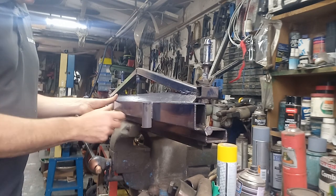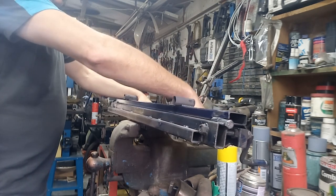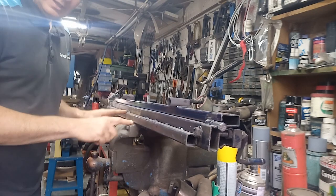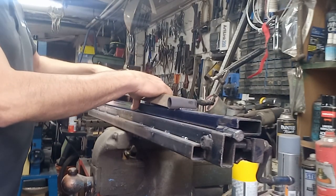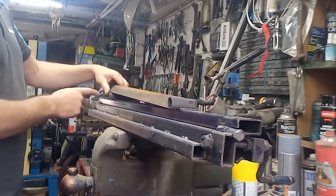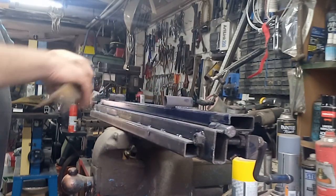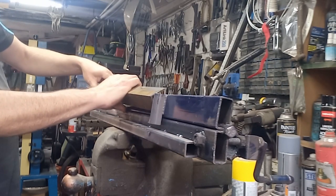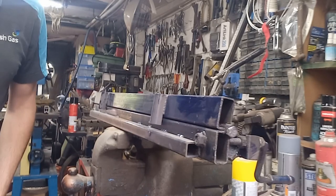There's got to be a way of doing this somehow - getting something on there - but it does mean I might have to weld another piece on there to bring this stuff to sit higher in the vice. I think if I do that first and then see where we're at, because what I'm thinking is something like a bit of angle between those two bits. On the edges we're okay, it's just the flex in the middle here, so I think a bit of angle cut and chopped off there and just stitched across there hopefully will give us the strength we need to stop that from flexing. But if I do that, by the time this comes back rounder there we're going to be losing strength there - or even a bit of box section just in there. Let's see what we've got.